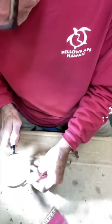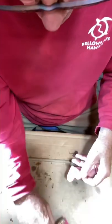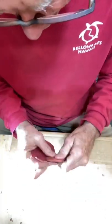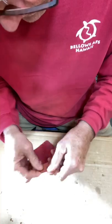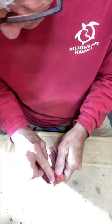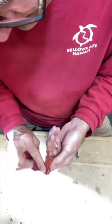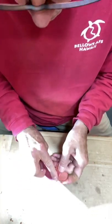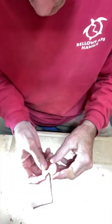I have a magnifying glass here and I go back to check really close and make sure I'm removing all those little hairline scratches. Because if you don't remove those hairline scratches before you oil the wood, it's really difficult to remove them after that. So I want to get everything cleaned out really nicely. I'll go ahead and do all the sanding now and show you the result after.